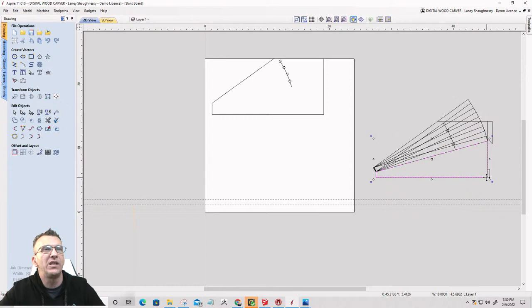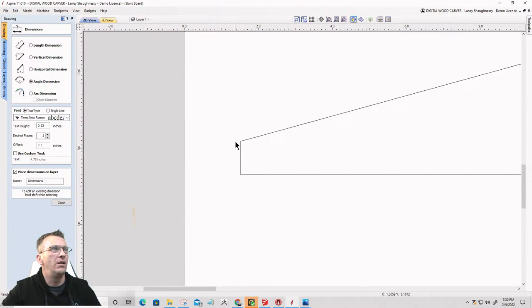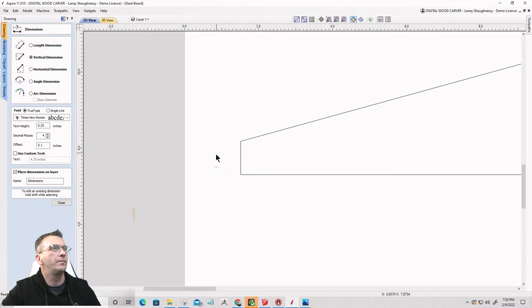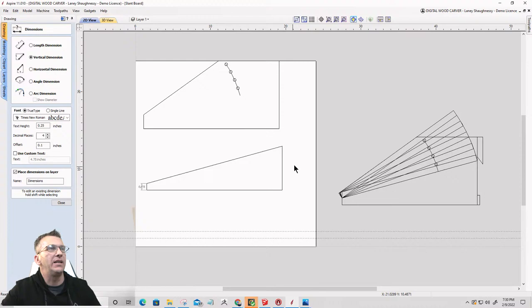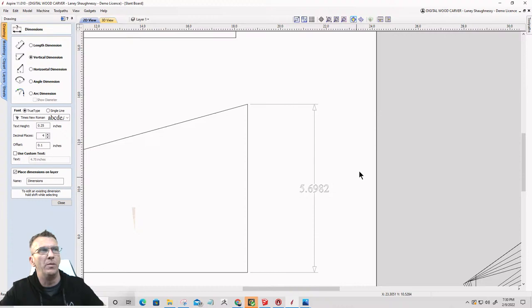This part here — that's going to be the shelf. I'm going to go ahead and cut it out on the CNC as well. I have a tapering jig on my table saw and I could do it there, but this is just a tapered piece of material. It goes from seven-eighths on one end and basically tapers up to just a little over five and a half inches — about five and nine-sixteenths — to get that 15 degrees.